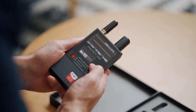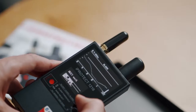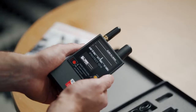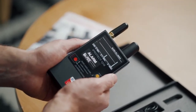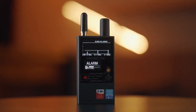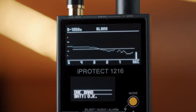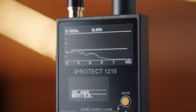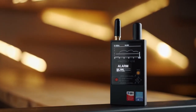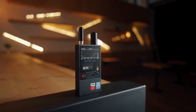The alarm mode is very convenient since it allows the user to scan quickly without watching the display. When the iProtect 1216 approaches a transmitter, the RF level exceeds the threshold and the device starts producing an alerting sound and the display shows the word alarm. Additionally, the threshold helps the user to mask the interference settings coming from outdoor broadcasting, communication towers, or neighboring wireless devices. To minimize false detections, the alerting sound appears after the signal exceeds the threshold during a predefined period.